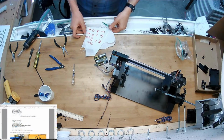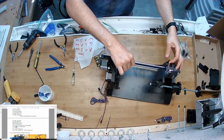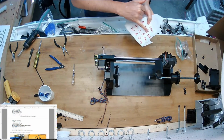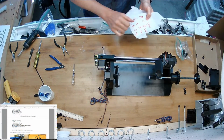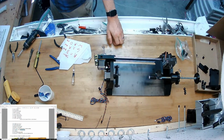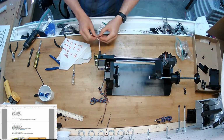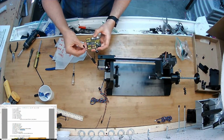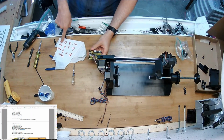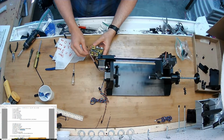Okay, so I just paused it and looked it up for that servo because servos have two different color codes on this wire. This one is brown, red, orange: brown is ground, red is power, orange is the signal. So on this chart here, I want the servo signal wire to go to the Z. Signal is orange, which comes on this end as white. Just go into a Z. Then I want the servo power, which on this end is the gray, to go to a 5 volt.